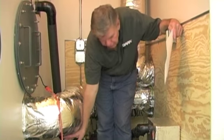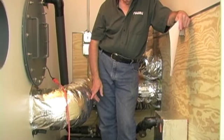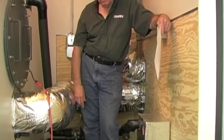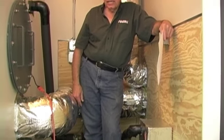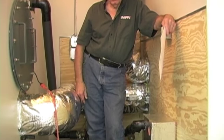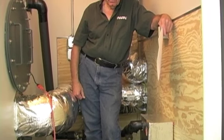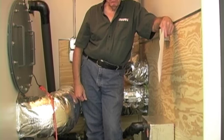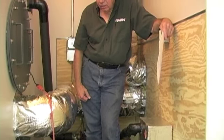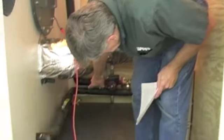But very critical thing, do not put a hose in this unit to fill it and walk away for a day. You'll spill hundreds of gallons of water in here. It does not take long to fill this unit. At 10 GPM well flow, this unit will be filled in about 3 hours. If you've got a higher flow rate, it'll be less. If slightly lower flow rate, it'll take slightly longer. Very critical issue. There is also a boiler drain down at the bottom.